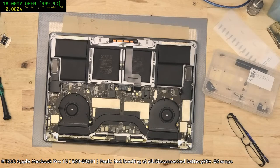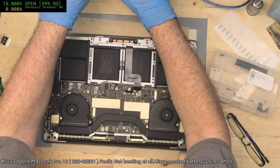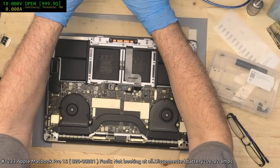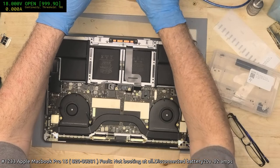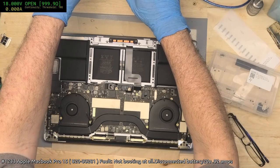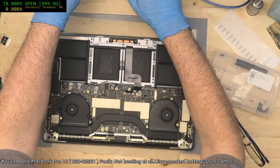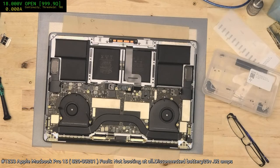Okay, so this was a short on C4206. C4206 shorted, replaced, various corrosion damage down left and right side of board undersides, flux cleaned. This will definitely have to go through an ultrasonic clean. I don't really like ultrasonic cleaning too many of these boards, but these ones aren't too bad. Boots to user login. Submit.